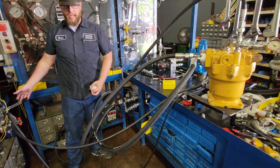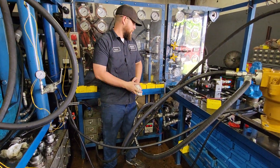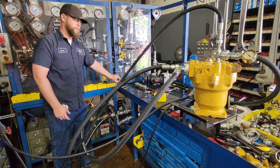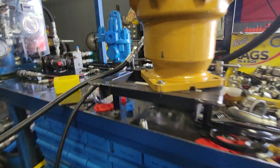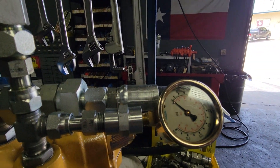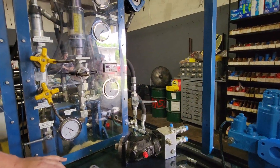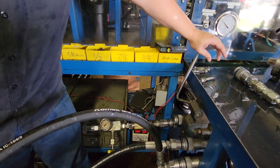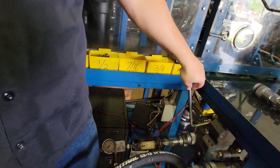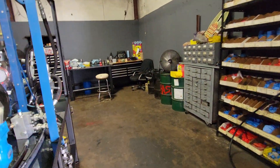So now I'm going to release the brake — take the pressure off of it. I'm going to pull this again. The shaft should stop and it should build up pressure once again to 4000 PSI. The shaft is not spinning. We've got our 4000 PSI. We've got about a gallon on the case flow. And the other way — very little case flow, very little case pressure, we've got our 4000 PSI that's relieving.